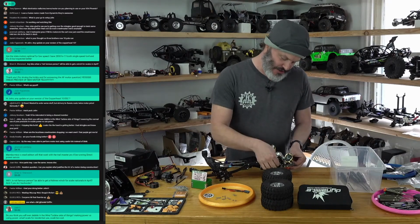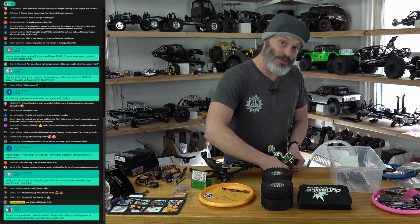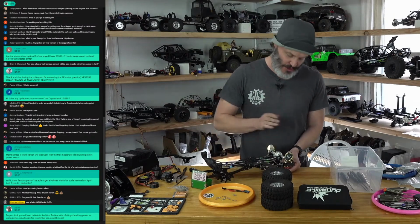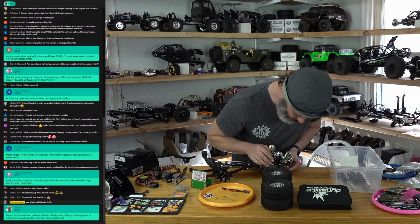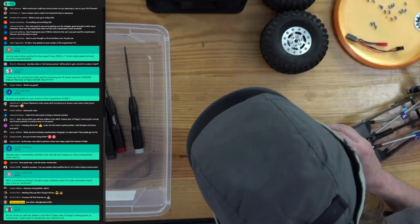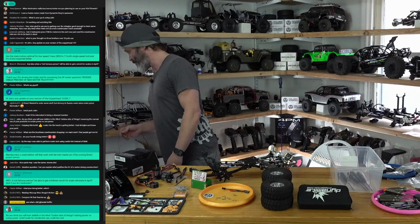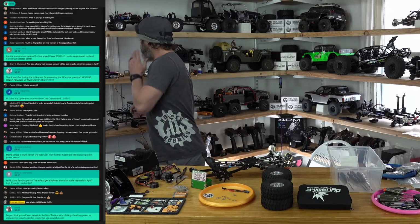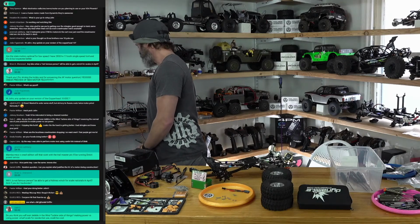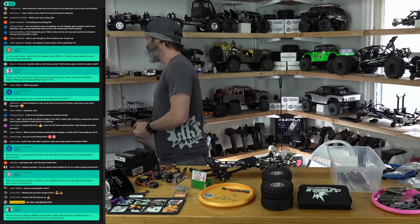But you could use this idealized method of measuring kV in the real world, and between motor topologies, you get a really defined answer that is consistent for all motors that you would test on your system. By knocking out the no-load amp draw, essentially you wipe it clean with your secondary motor that spins faster than your test motor. Of course, it has to spin faster. And only then will you have tested and found your true kV value.